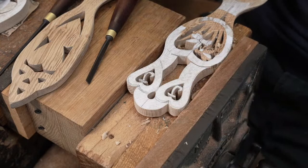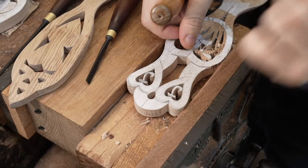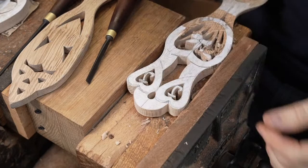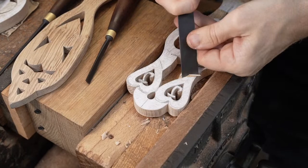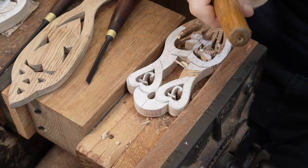And so you have to go back to the original direction, but what you do is take out a smaller cutting, a smaller shaving. That's what I would do: instead of taking out such a large amount, take out smaller amounts. So that's another thing to consider if you're having problems with that particular thing: reduce the amount that you're actually cutting out in each cut. And it's finding what suits you, what works best. Be very open to learning from the wood itself. The wood will teach you so much.